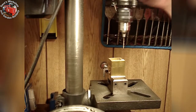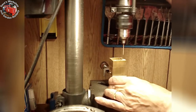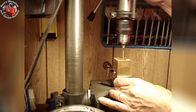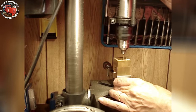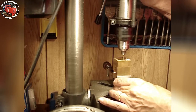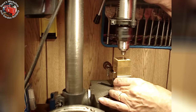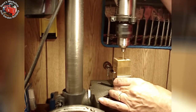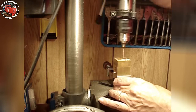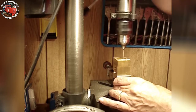Here's me drilling five holes. Most of this has been sped right up, but you can see the progression of the drill. The drill needed withdrawing all the way to clear the swarf from the depth. The drill is 1.8mm for 8BA tapping. Very little force is required to hold the drill vise from turning.